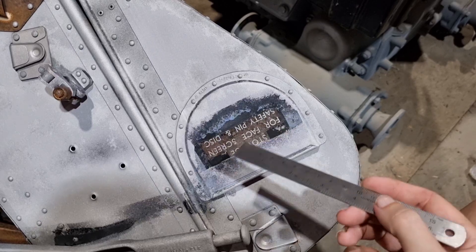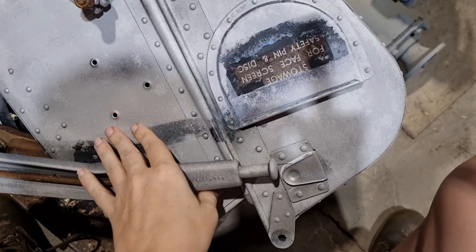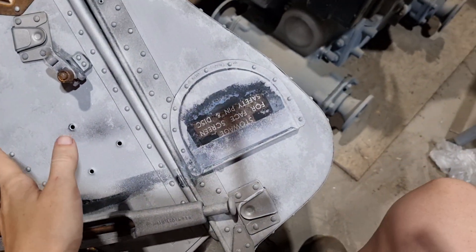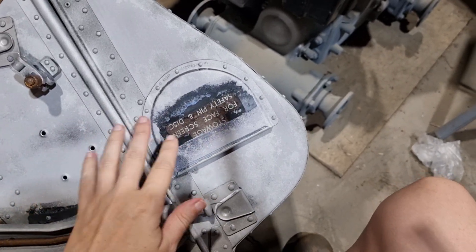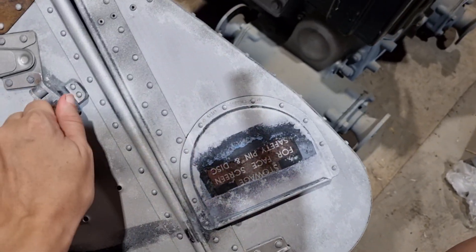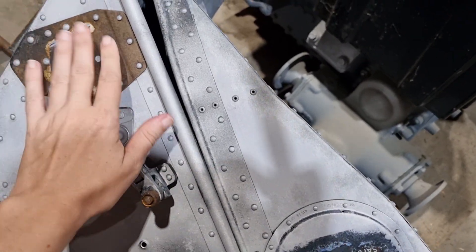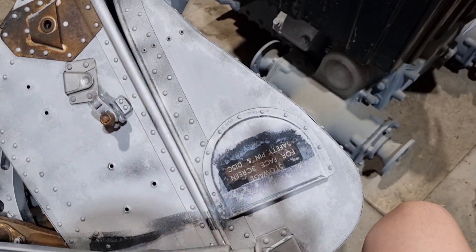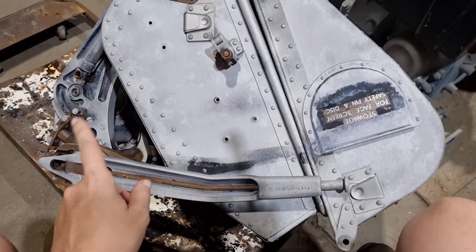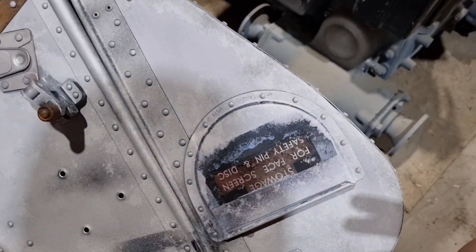So we've got the sandblasting done. We've still got a couple of little bits, but it's smooth, which is all that's important. Obviously this is all getting repainted. Now I've got two steps to do: one, I've got to get rid of this tape that I used to cover this; and I just need to process these a little bit. Now with that, we've got some surface rust — flash rust — after being sandblasted. So I'll just hit them with a wire wheel, and then we'll cover the metal bits first, and then we'll do the aluminium after, because that can sit quite a bit longer.